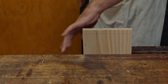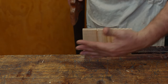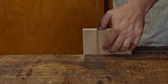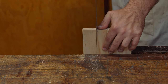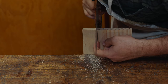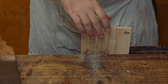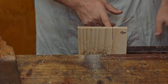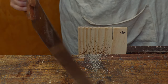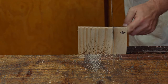Just want to listen to the sound — I could hear it was moving, that's why it was making that large vibration sound. I've got my board down quite low in the vice so I can get a bit of a start but not too high that it's going to vibrate. Now I can see it's moving off on this side, so I'm going to rotate the board around to my side. This side is being problematic, which means my saw was probably angled slightly. I'm going to nibble it back to the line a little bit, using the side of the saw teeth to bring it across.